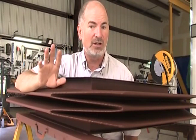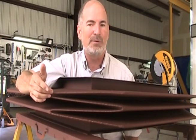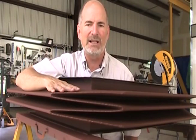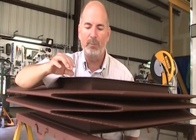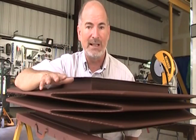These types of designs cause end users two different problems. One, they tend to crack in the corners because these were mainly designed for ease of manufacture. They slide them together and then do a cap weld across there — not even a full penetration weld. Plus, all the stresses are in the corner and that's where the welds are, so that's where it's going to crack.